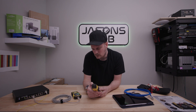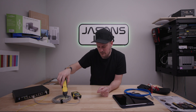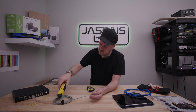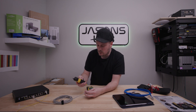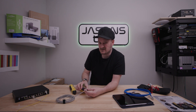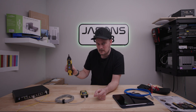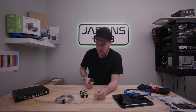If I turn this to non-digital mode, you hear the noise — it's making a tone, but it's not the right tone. If we go in with the probe, we can hear all the noise because we're in analog mode on this cable. But digital mode is what we want to use. If we keep it back in digital mode, there's no noise. But if I plug this back into the switch, this thing is going to make lots of noise again, as we can see. So we're on an active network and not having any issues, and we can find the cable. It works very, very well.